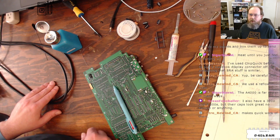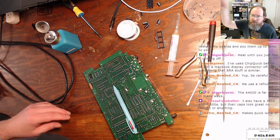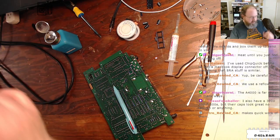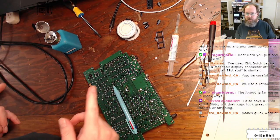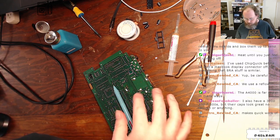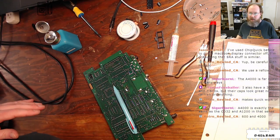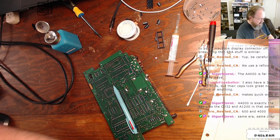Yeah, I don't know much about the Amiga models, which ones really need recaps, other than the 1200 and the CD32. But anyway, rather than using the vacuum gun, for people who are interested in removing stuff, and again, I caution people, don't learn on old equipment, right? It's very unforgiving. But in case you do need to do some of this stuff, I'm going to show you how it's done with a wick. Let me get my solder wick out.